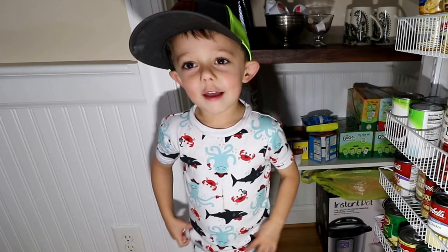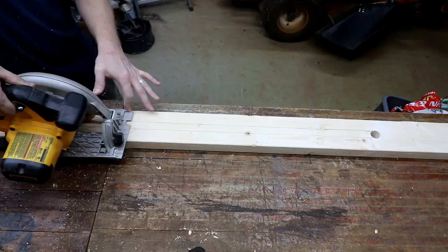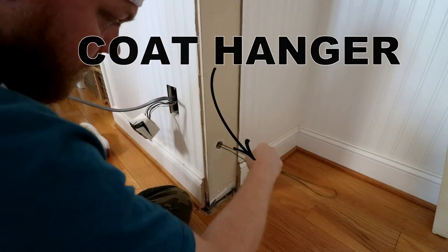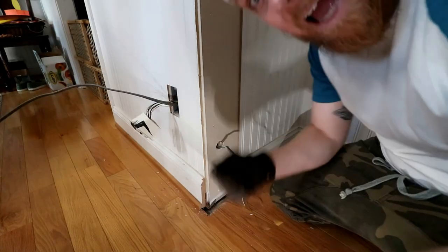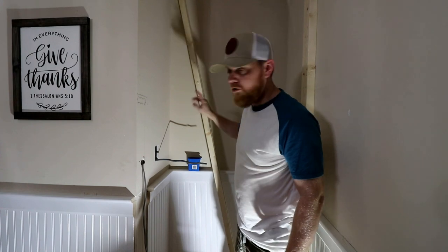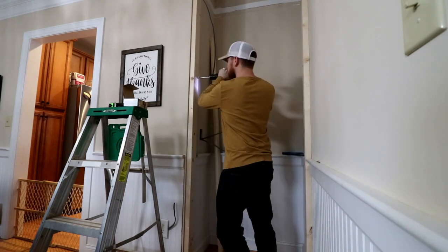As far as the difficulty level on this project, as long as you're a carpenter, painter, and electrician, you should be fine. When I thought about this before I put the 2x4 up and cut the groove, I actually needed to carry it on up above where the door is going to be framed out, because from this outlet I'm going to run a wire back through and up to the light that we're mounting above this door.